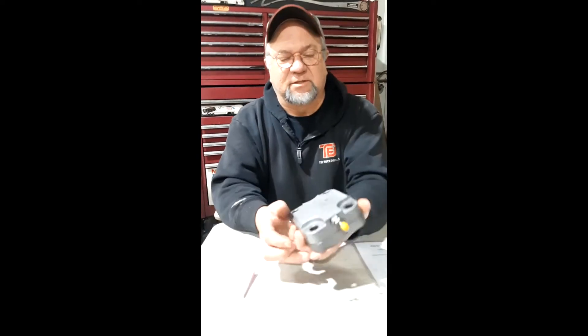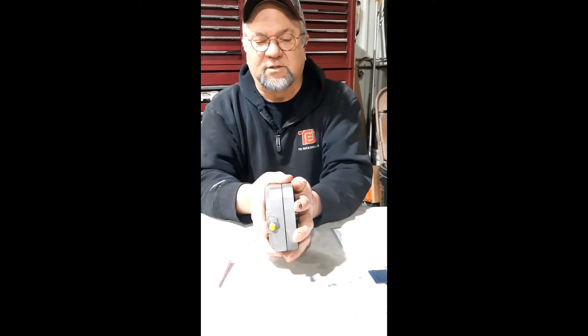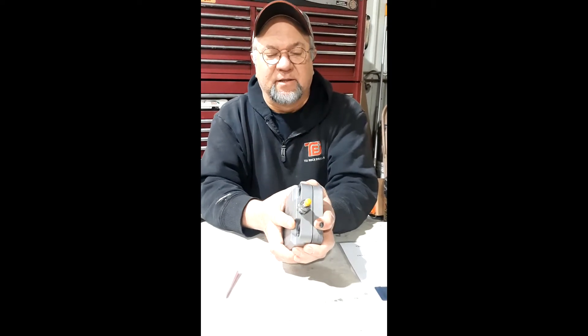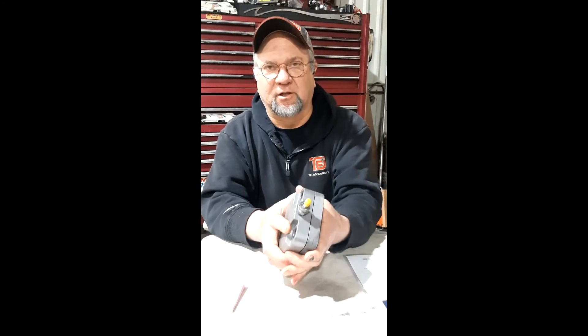This is an accumulator on one of our drifters. It's bolted to the side of a drifter and you've got a high side and a low side. They really don't matter until you charge them, and you've got to charge them correctly — you've got to have high pressure on the high side and low pressure on the low side.